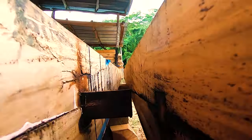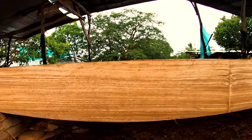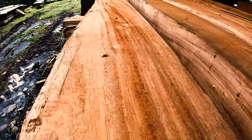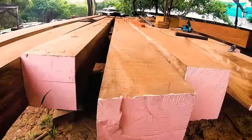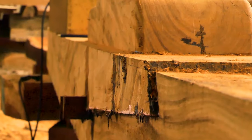It's quite simple — you just plug in your camber, however many inches that is. The longest main deck beam is 24.2 feet and that is cambered; I think we used about five and a half inches. Then you just divide that space up, plug the numbers into the formula, measure it out, and spring a batten.